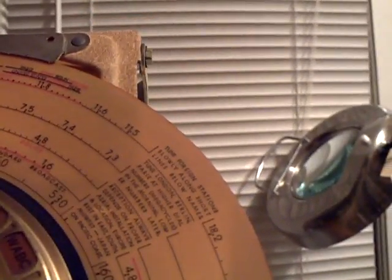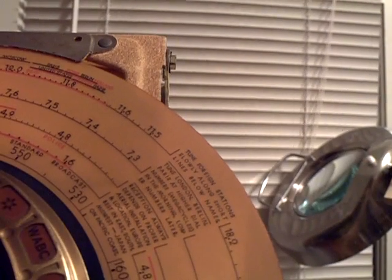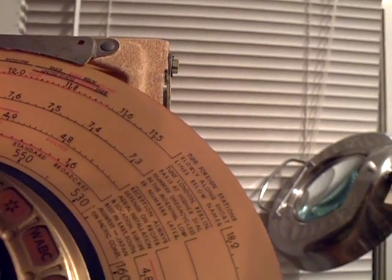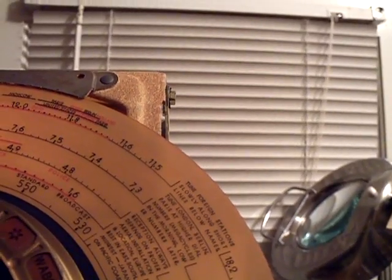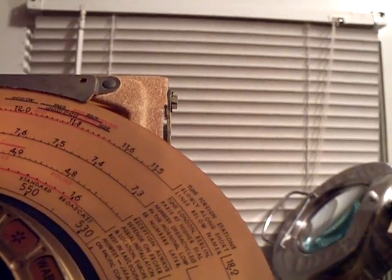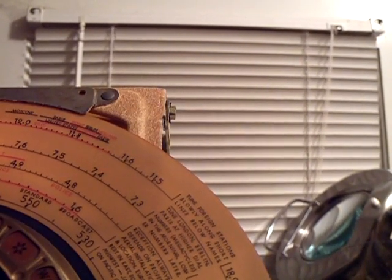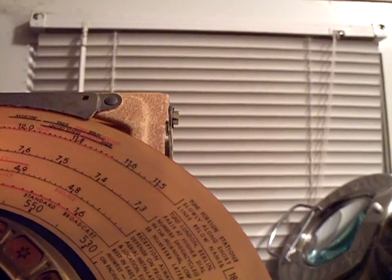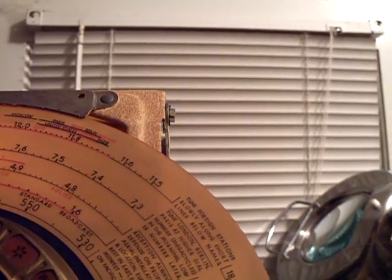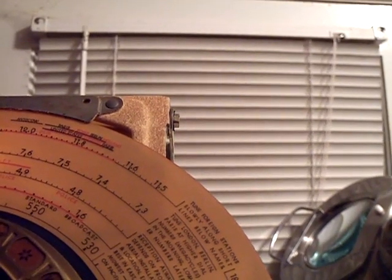I just want to mention that a lot of times when people repaired radios in the 30s or even 40s and 50s, they didn't really align them a lot. Well, I shouldn't say in the 50s, but I know that in the 30s I read that a lot of times when they repaired radios, they had to send it out to get aligned, because not everyone did alignments. But for two, I did have a stuck adjustment, 52B. I cannot unstick that. That IF transformer was really stuck, and I didn't want to force that at all either. I'm just assuming that where it was stuck was a pretty good position for it to be stuck in, because the radio was never worked on.